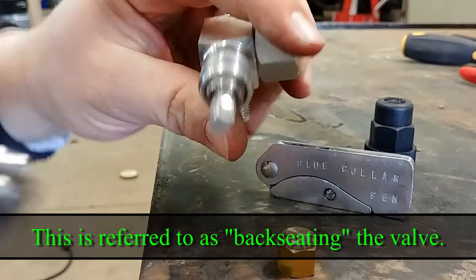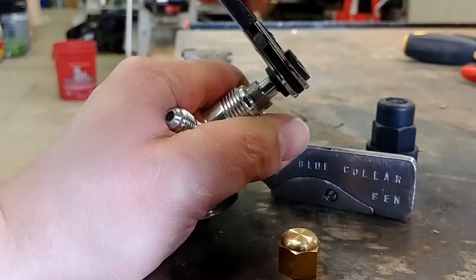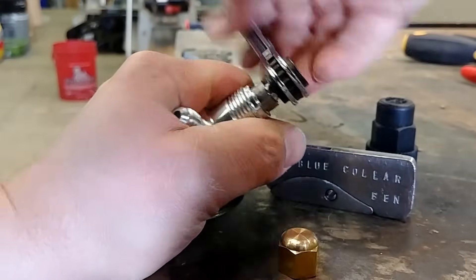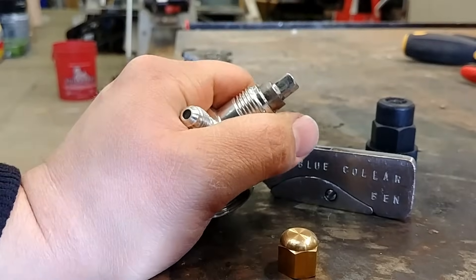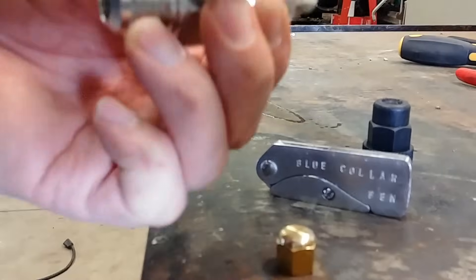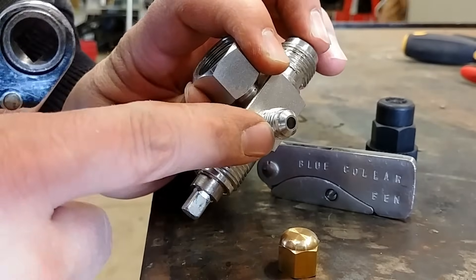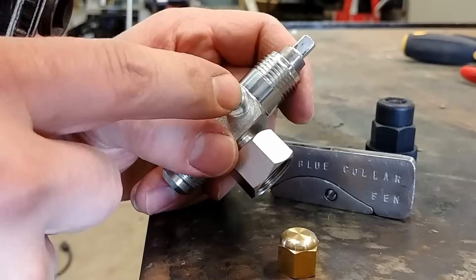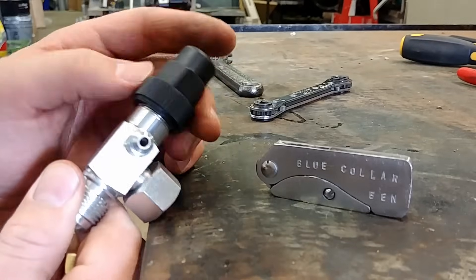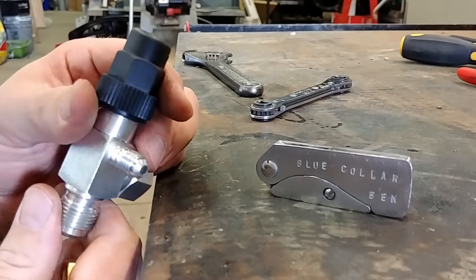You want to get this nice and just snug when you open it up all the way. Now when you close it all the way down, anywhere in between all the way open and all the way closed, all those ports will be a little bit open. When we close it all the way, this port going to the compressor is still open to the access port. So what that means is you can put your gauges on here and it's going to show you the pressure of whatever is inside of the compressor. These plastic caps — when you tighten these down, make sure you don't get them too tight because they are plastic and they will crack. Just get them finger tight and then maybe just a tiny bit more with your channel lock.